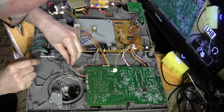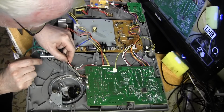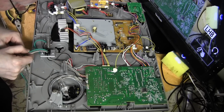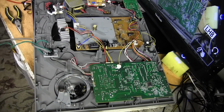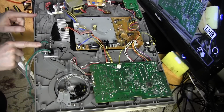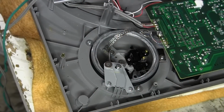There, that power cable for that preamp is just tucked neatly underneath there in case I ever want to reconnect all that. All the grounds are connected, everything's good. I did a continuity and short test, nothing's shorted, everything's working. It should all work when I get it back together. I put the screws back in too where the amplifier was, that way I don't lose them.